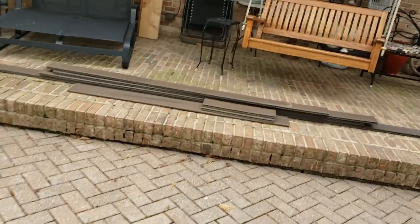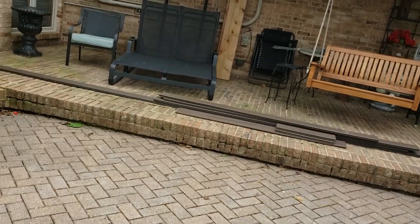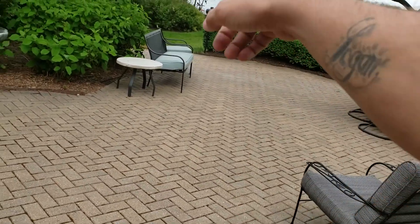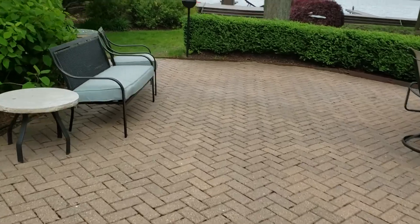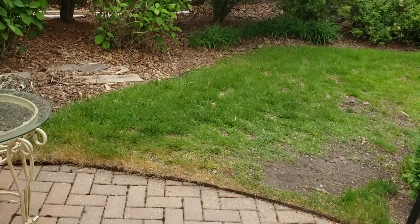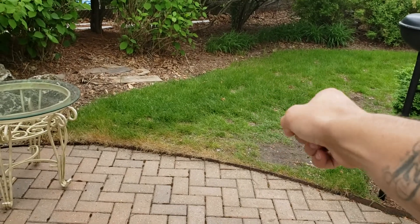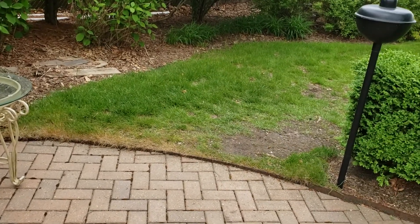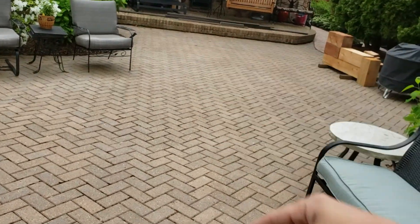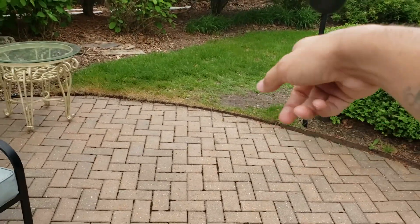The idea is to pick the patio up by a couple inches here. It doesn't necessarily have to be a couple inches, but the idea is to pitch it that way — lift it up by whatever it needs to overcome this point here so that the water is running off. You're going to make a big impact by lowering this section of the grass. This section of the pavers can't go up, because if you raise it, you have to raise the adjacent section even more, and we don't want that. We just want to get it pitched by lowering the grass here.